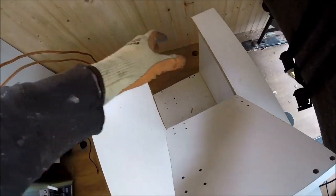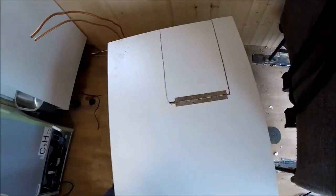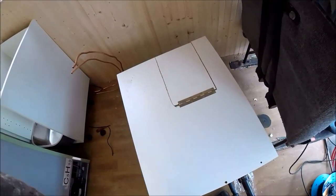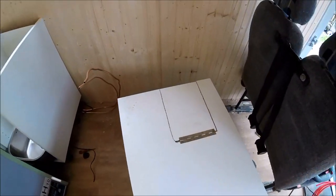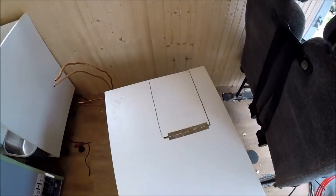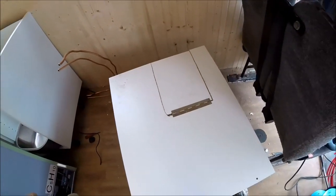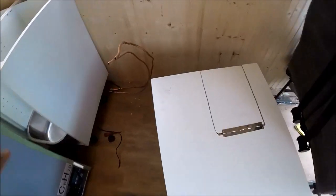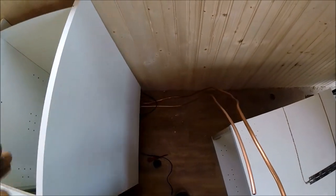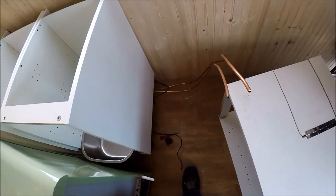fittings are for both the hob and the oven, and then when that's in place just flip the panel back up. And obviously when the other section of Conti board's pushed right against it as well, that'll still give a nice, neat, full finish, and you won't even be able to see the access panel unless you actually need in it for some reason. But again, because this unit's going to house most of the gas appliances, the hob and the oven, the unit itself's going to have a dropout hole, and I'm now just going to drill a dropout hole straight down through the floor, just in case there were any issues with the gas, of which there shouldn't be.